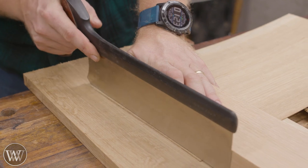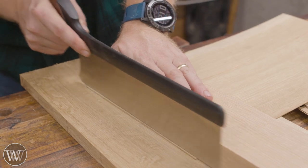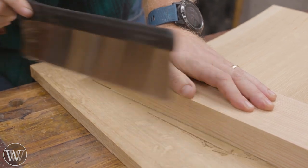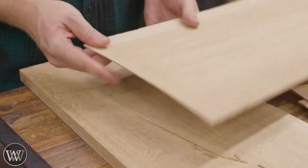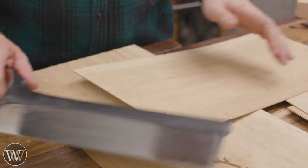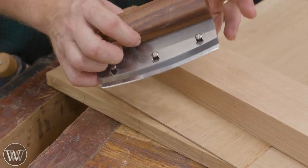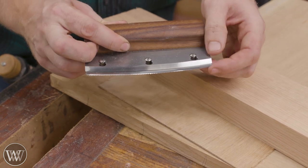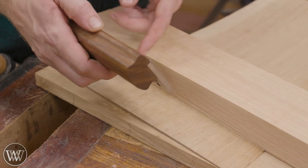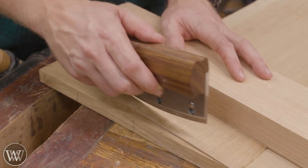Just take my time. This is a carcass saw with cross-cut teeth, and I'm going to very carefully and slowly cut across it. And there we go — a nice clean edge ready for the work I'm looking for. You can do it with just a normal saw, but it's a little bit finicky. With thicker veneer like this it kind of is useful. That's where our good veneer saw comes in — these teeth cut very differently from a normal cross-cut saw. If you're having a problem with things sliding around, you can actually reverse the angle on the French cut to get an easier cut.